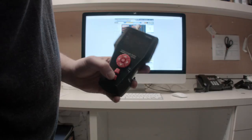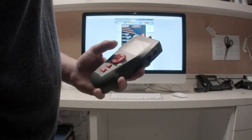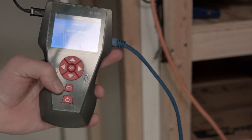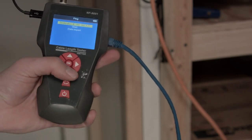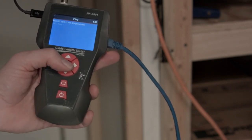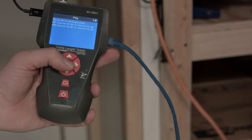Let's go back over the ping feature. If you want to make sure a particular device — like a computer — is properly sending and receiving information, or see its response time, just enter its IP address, go to start, and hit enter, and then you've got it.